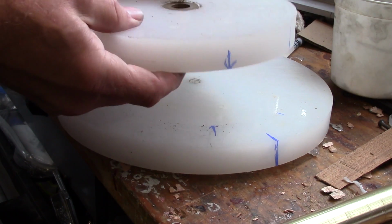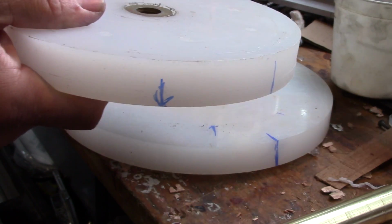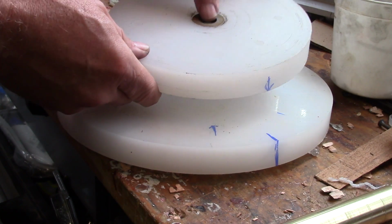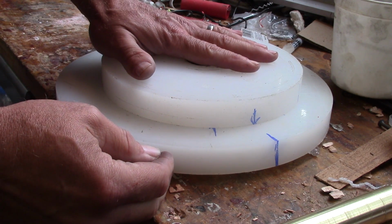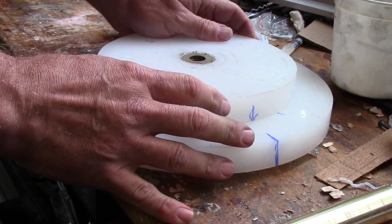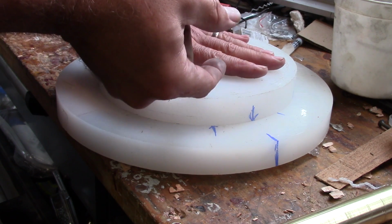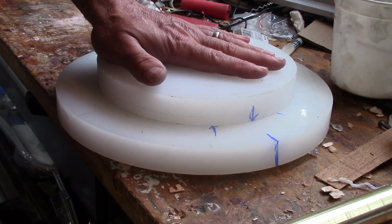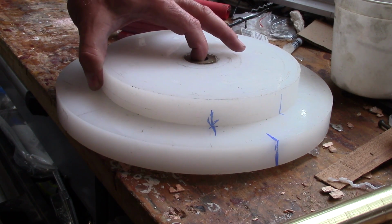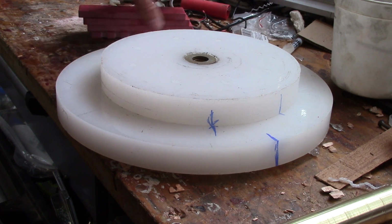And this is just some LDPE soft stuff. I gotta clean this off before we go much further with the running of the coil, but we're still in construction phase. I put 2 of these on top of each other, gave me 2-inch further height, and that's to provide the correct coupling constant to keep the first turn of the secondary an inch above the top of the primary. So all those dimensions have got to be taken into account, otherwise things won't work, and you'll have done all this work for nothing.